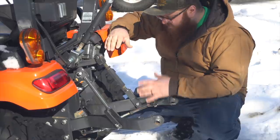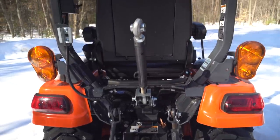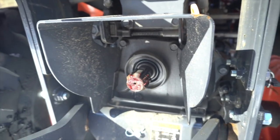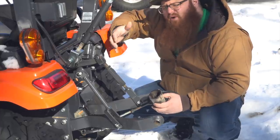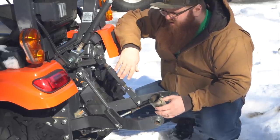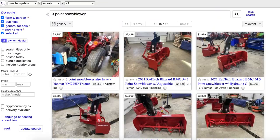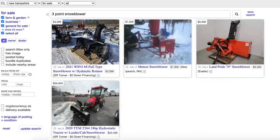There are different sizes of these snowblowers and different sizes of rear three-point hitches, so if you buy one you want to make sure it's going to mount up to the hitch on your tractor — whether it's a Category 1, Category 2, or Category 3. And almost without fail they're going to be powered by your rear PTO, which drives the implement. The horsepower of your tractor definitely needs to be sized to the horsepower of the implement as well as the size of your three-point hitch. That said, as long as they're sized correctly, they're fairly universal and relatively easy to come by. I can go on Craigslist right now and find six or seven within maybe an hour's drive of me.